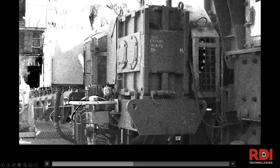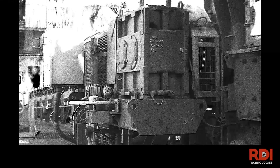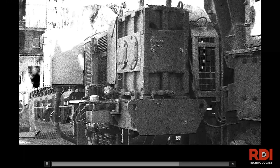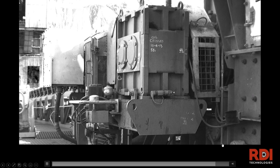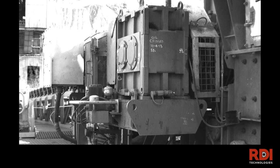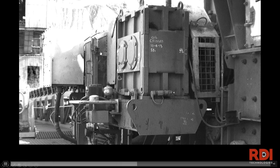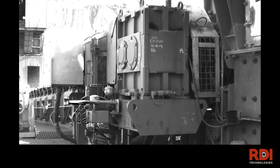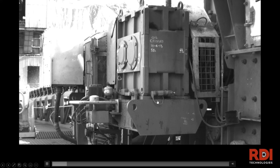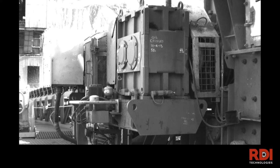Here's a typical acquisition of a gearbox that's moving. We can filter for the output frequency of the gearbox at 2 Hz, then the 25 Hz for just that motor, and then another frequency in the background — something that was not very obvious, but actually turned out to be the conveyor bouncing. That conveyor ended up being the biggest issue of all, unknown to them beforehand.